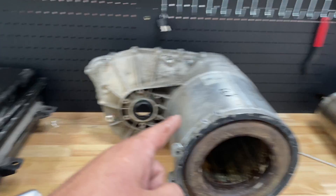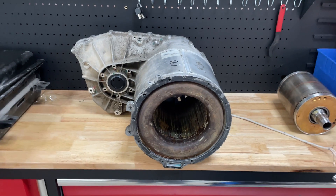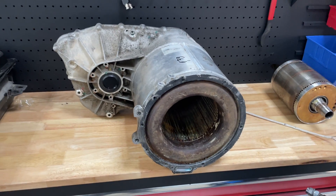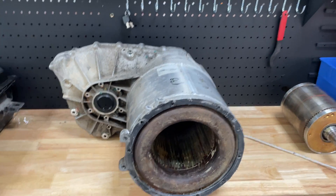Each phase when disconnected should be above 6 megaohms. The complete damaged stator has something around 1 megaohm. We were struggling because in cases where we have an issue with the stator, even if we refurbish everything else, we do not have a solution for the stator.